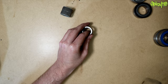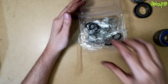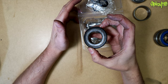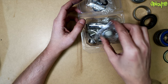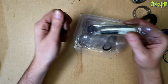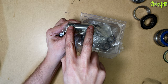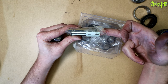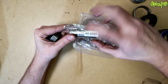Because I didn't change the swing arm pivot bearings on my DR when they seemed okay, I still have these left over for when I discover they weren't okay. Here are the seals — this one has a seal pressed onto it. These are the needle bearings for the swing arm pivot: a shaft goes through the middle of a couple of needle bearings, and this inner sleeve is the perfect size to fit inside them. Your axle bolt goes inside, and once it's all filled with grease and clamped, the outer sleeve moves independently of the inner because of the bearing.